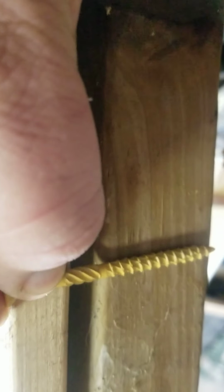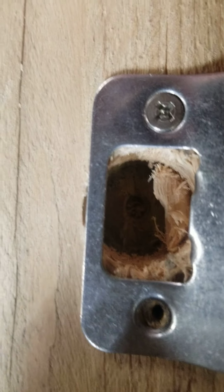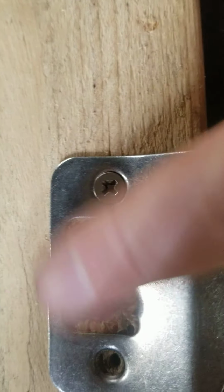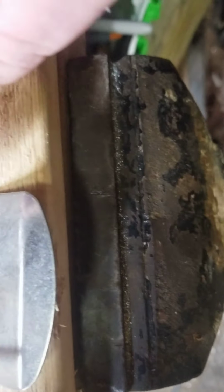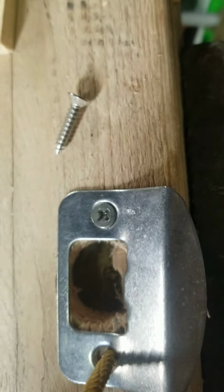So this locks this board to that board, and if you have it shimmed properly, then your hole will have reinforcement behind it, above and below and here, just for the regular door strike. So this here now strengthens the door versus this little bitty guy. All right, so that's one on spreading.